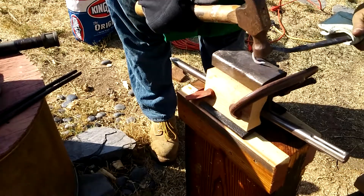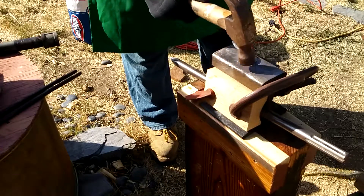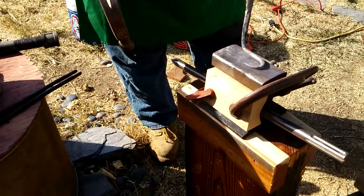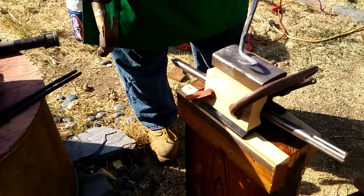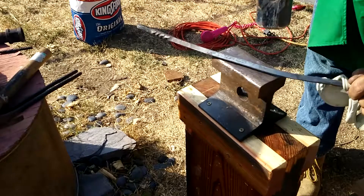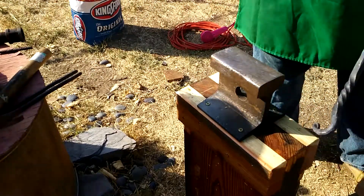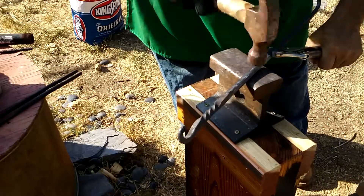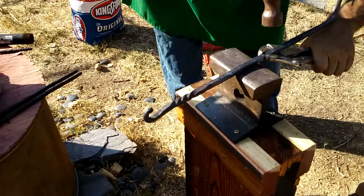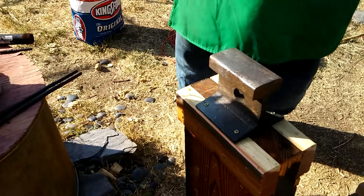I noticed that you see my feet a lot in this video — it's a good thing I was wearing good shoes. I'm going to have to correct the camera angle in the next video so you can actually see more of what's going on. I refined the tip just past that burn mark and then took it over to the grinder. Then I added some texturing to the handle. I discovered that the claw hammer I've been using has a horrible texture on the surface from hitting nails, but that makes it a perfect texturing tool for blacksmithing — I used all those imperfections to cover up the imperfections from my clamps and tongs.